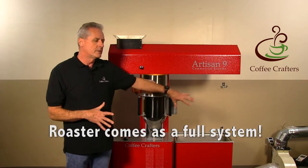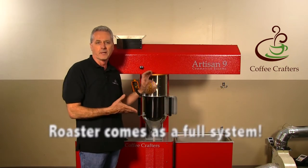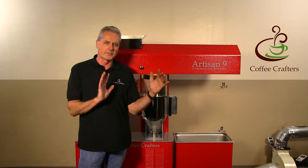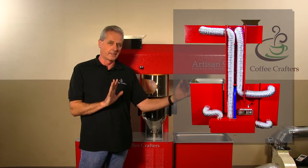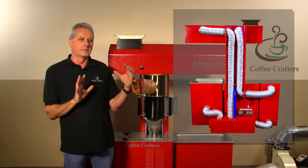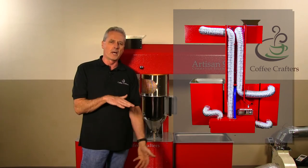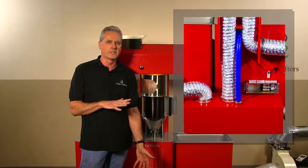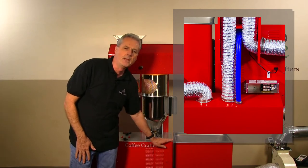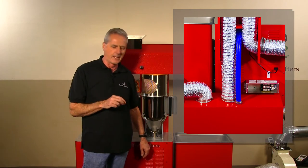This roaster is sold as a full system — it comes with all the ducting and tubing on the intake side to do all the plumbing on the back. Let's show you a still picture of what this roaster looks like on the back with the venting. Everything is nice and neat and clean going into the mast. On the very bottom of the roaster you'll see the plenum — that's the air handler that shares the air. That blue silicone hose is what's sucking the air off the top of the heat chamber, keeping the roaster cool. It moves about 25 CFM, maybe a little less, but it's enough to keep it cool.